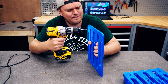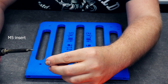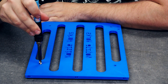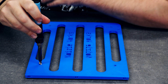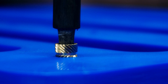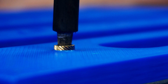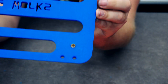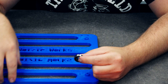Just like this. Once that is done, you take your insert, put your soldering iron on it like this, and start melting it into the project just like this, ever so slowly. Once you've done that, you've successfully added threads to the sidewalls.